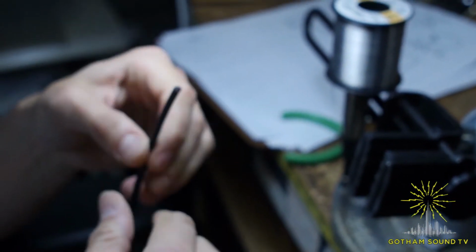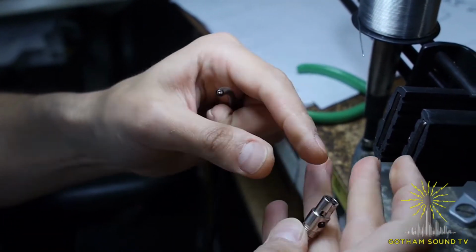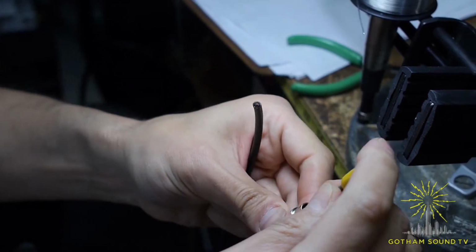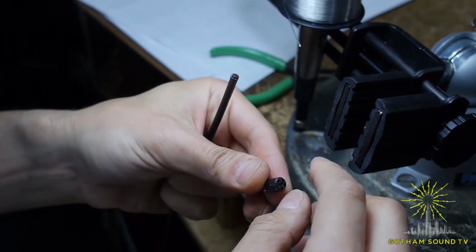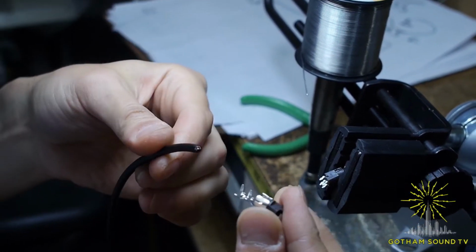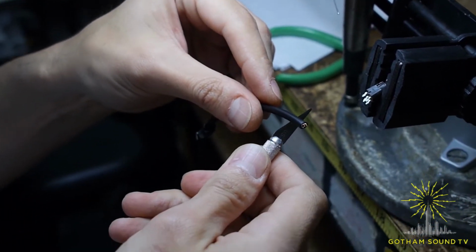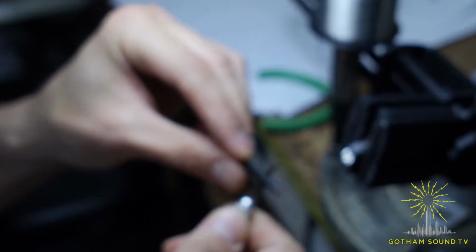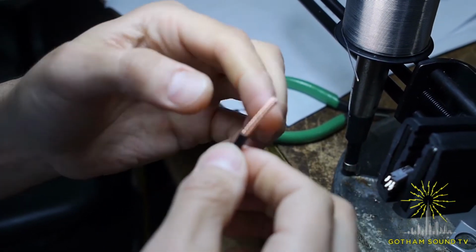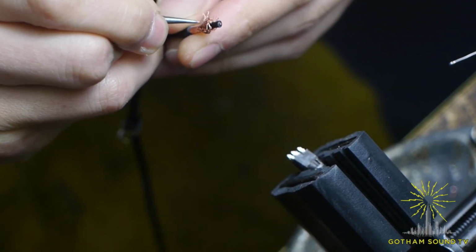And the connector B is a TA5 female. First thing goes boot. Then we take the connector apart, and put the insert into the vise right here. Now I'm going to put this part in here, and we're ready to work on the cable itself. So I'm going to strip about 1 inch right here and do almost the same operation which I've done on the other side.